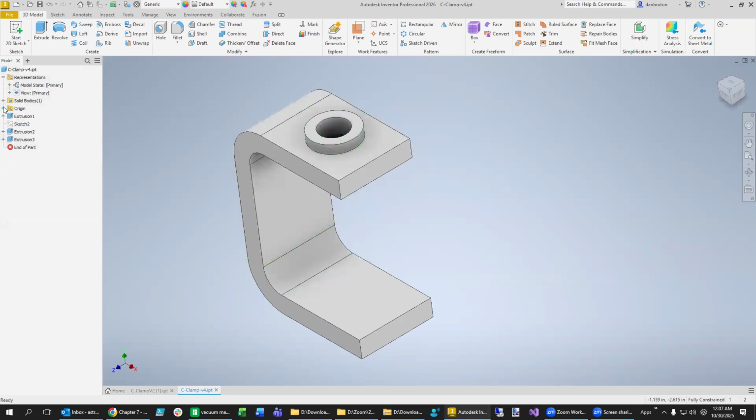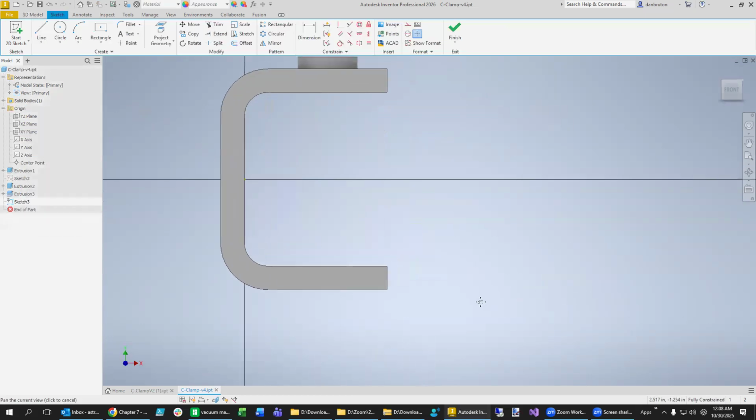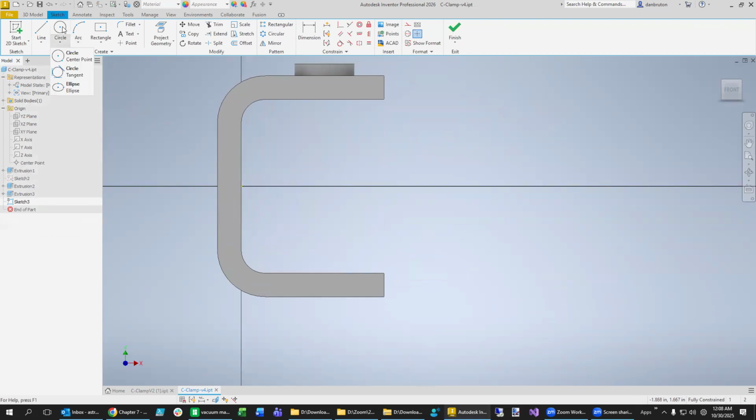We're going to go over here to the side view. This one right here, right click, new sketch. And we'll just put that 1/4 inch circle right down here. We want it to be directly below this one so that the weight, see if I can get this to move down. There we go. So that the weight is right below the point of contact of the foot, or the center of the foot, rather. So let's see if we can do that. If we measure from here to there, that should line up to be 0.75 and be directly below that.